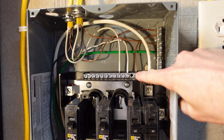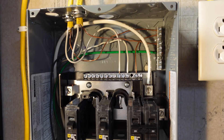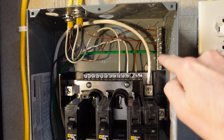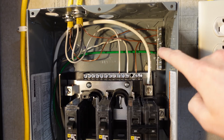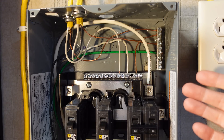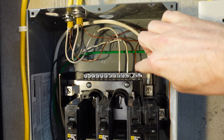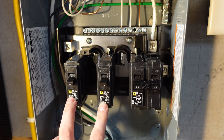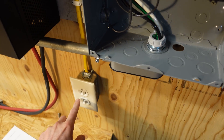You'll also see I have a piece of copper wire coming from the neutral bar and going up to the ground bar — this is the ground-to-neutral bond. I could have just landed all the neutrals and grounds on a single bus bar and wouldn't have needed this separate ground bar, but I wanted to keep them separate in case I use this panel for other inverter testing. I also lost the screw that should go through the hole bonding that bar to the case — irrelevant for this video, but I know someone would call me out on it. I've got two 20-amp breakers here: one goes up to an outlet up here and the other goes down to a separate outlet below.